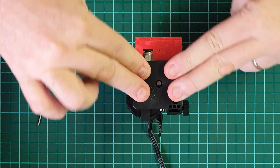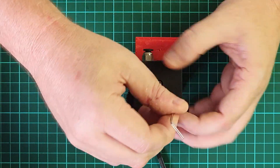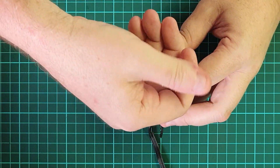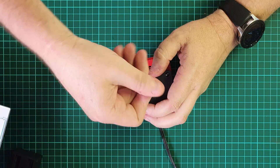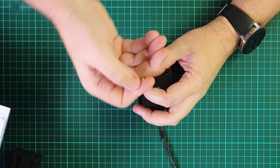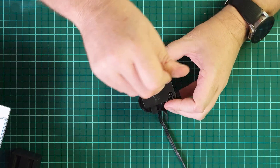We then take this part with your bearing at the top — this is your main lid — and that goes on. Then we can put the two long screws on the left hand side. I'm just going to get that one seated, not tightened up, then put this one in seated as well. Finally the midsize one goes on the right hand side, and then we can tighten up all of our screws.